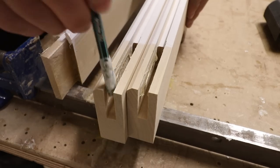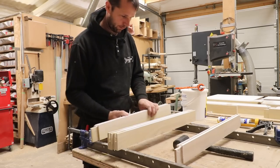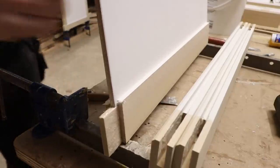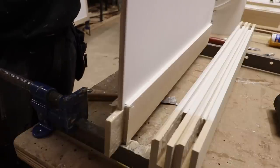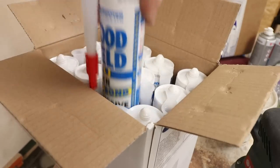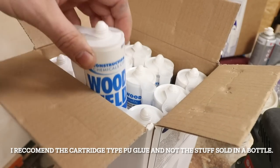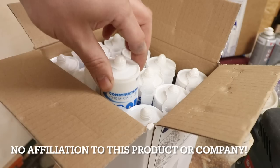Don't put any glue on the tops here because all that does is encourage too much glue squeeze. I get asked in every single video what brand of polyurethane glue I recommend. They're all slightly different and it depends on what I want to achieve, but in general the Wood Weld adhesive from Construction Chemicals is pretty much my favourite go-to adhesive. I always go for the 30-minute version — in perfect conditions this stuff has still gone off in about five minutes, so it's just a little bit slower than the other stuff.